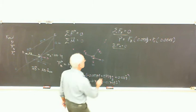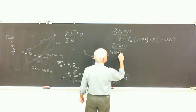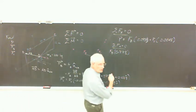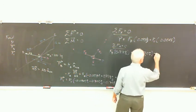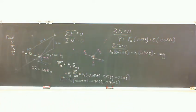All right, so B, all the up forces, FB times 0.778, right? FC times 0.705, are those both up in the y direction? Yeah. And that's got to equal the weight down. So we'll put it over there on that side. That way we don't have any minus signs in the equation. That's all. It's just algebra. Did I forget one? Where's P? Where's P? It doesn't have a Y component.